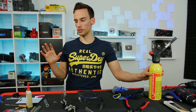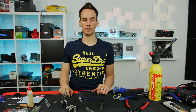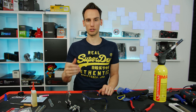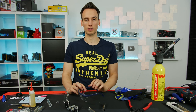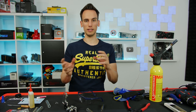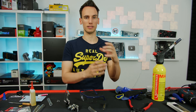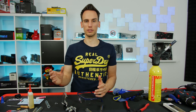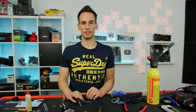The conventional tube cutters - forget about them, they're not made for glass. Thank you very much for all the comments in the previous video - it was extremely helpful to read through everyone's ideas. If you still have any other ideas, feel free to leave them in the comments below. About the temperature change method - a lot of people mentioned cooling and heating with a string, like turning glass bottles into drinking glasses - that should not work on borosilicate glass because it's extremely resistant to temperature changes. But if there's any other method, let us know in the comments. Thanks for tuning in and see you next time!